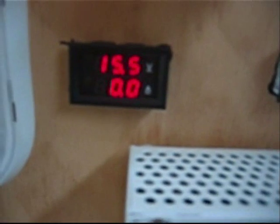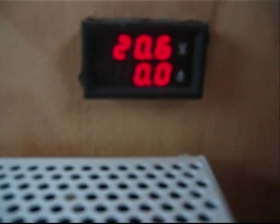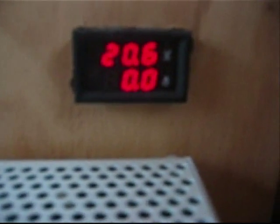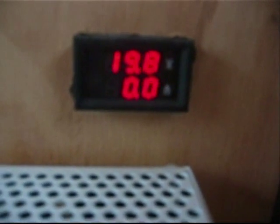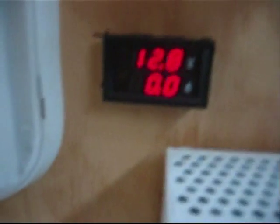Showing that battery bank — which is off and back-feeding — it's showing it at 14. It finally went off; just took the battery bank a minute to go off. You can see the solar panel is bringing in 20.5 volts right now. We'll go ahead and turn the battery bank back on, and you'll see a big difference — that voltage should start to drop on the solar panel as it goes into the batteries. They're down to 19... 18.1... hits 17, 17.5 there, and showing the battery bank at 12.8.